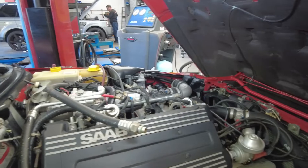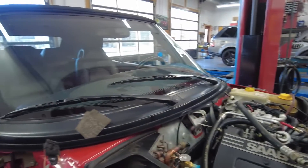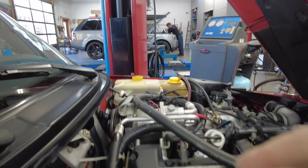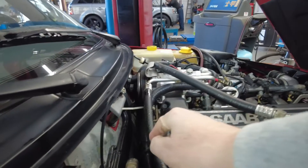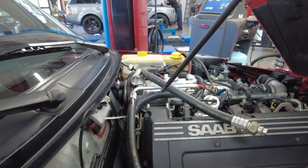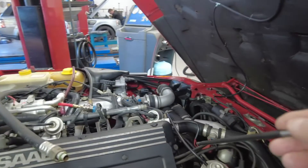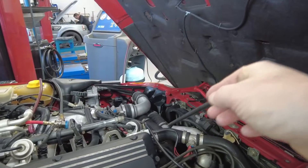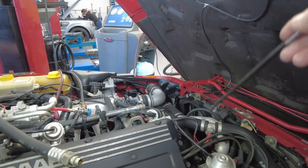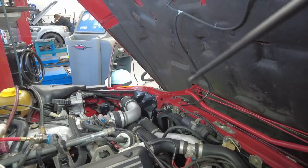First, about the system. If you're familiar with the components of the air conditioning system you can skip through; if not, stay tuned. We have the engine here — don't be surprised, the belts on the Saab are facing the firewall because the engine is oriented 180 degrees. The front of the engine with the timing chain and belts faces the firewall, the transmission is under the engine, and you can actually replace the clutch without removing the transmission — very cool.